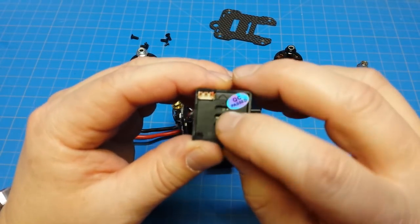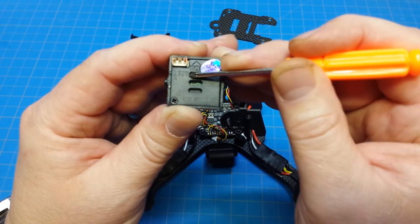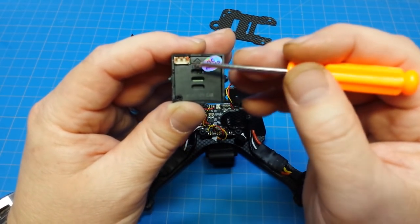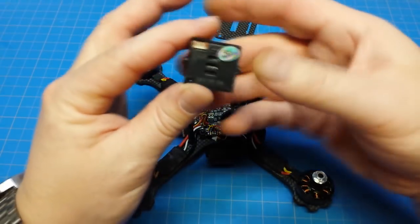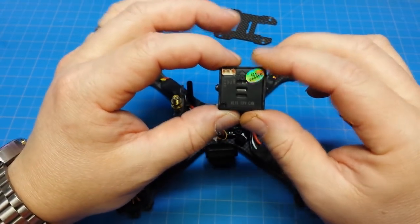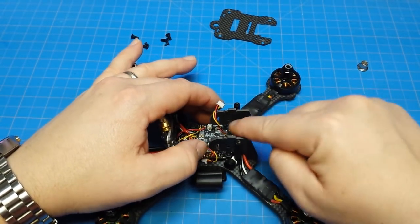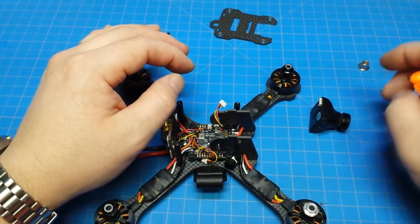Here we can look at the back of the camera. This pin right here says OSD, and it also says 5 to 24 volts. This is very similar, if not exactly the same, to what we'd see in RunCams and other cameras at the HS1177 form factor. This is the pin we connect to for the OSD, but the connecting pin is missing that fourth wire — they don't include a connector to change the camera settings, so we'd have to source that ourselves. Getting this camera out was a nice surprise — it's really securely put in there. They've milled out the holes so the side pieces fit down inside and you can get them nice and tight, so your camera angle should hold fairly well.